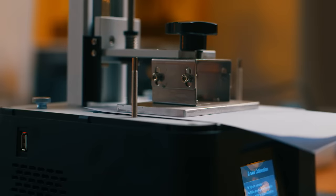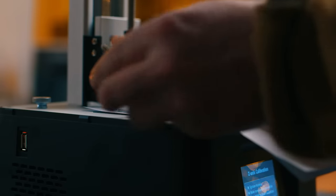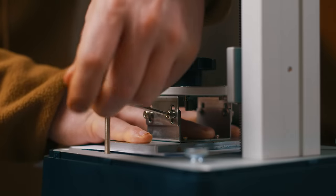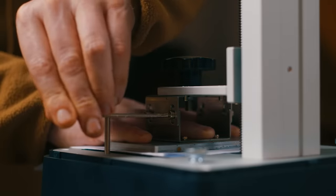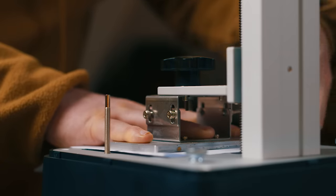Now there's a way to do this: apply your pressure to the build plate evenly with one hand and then do alternative bolts. So say you're starting on the front left, go to the back right, front right, back left. And tighten that up with even pressure while you're still maintaining your hand pressure on the build plate.